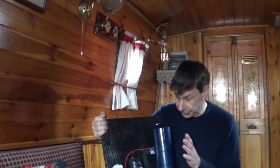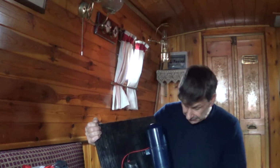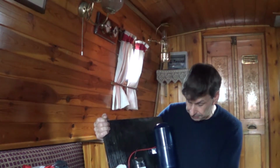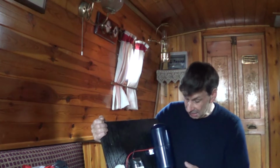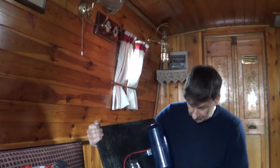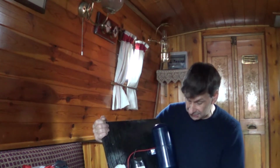But the job I want to start to try and do is fit this new water pump. It's basic stuff on this boat. I've made this board up, and I've got a new PAR 2.9 cold water pump there, and a little accumulator tank there to keep the pressure balanced, and I'm going to try and do the whole boat in this poly pipe push fitting. The plastic fittings seemed better than the plastic cold or red water hose you got, which is on this boat, which I'm going to try bit by bit to do away with.